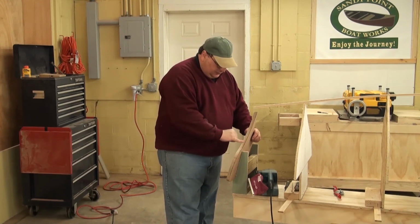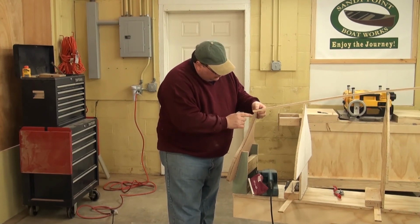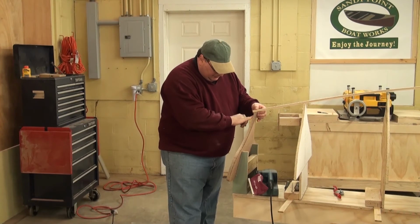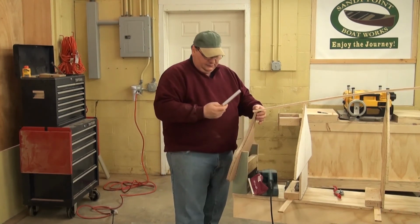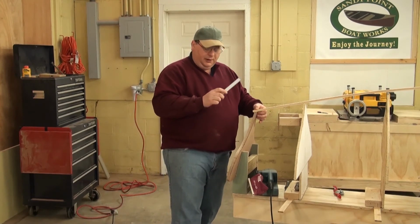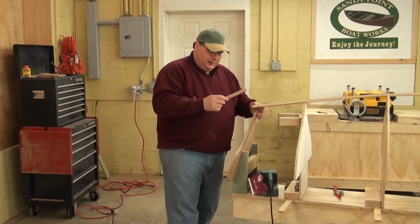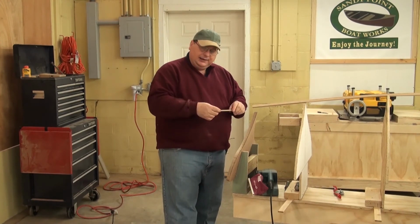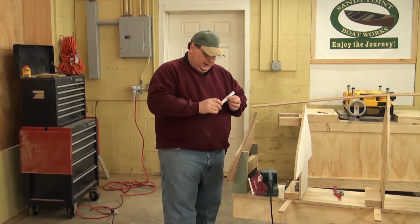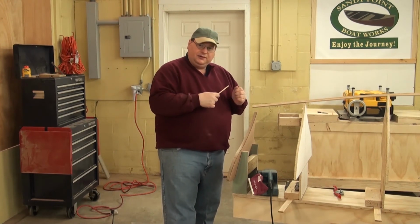All right. So I'm going to take the belt sander, and you can see that up top here I have already beveled the top of this thing. For that, I got this really simple tool that I find works really well. I take 60 grit sandpaper over a 1/4 by 3/4 inch piece of hardboard. With the spray glue that we put the patterns down with, spray a little bit on the wood, lay it down, and then cut the sandpaper. It basically makes a little rasp. And as this starts to wear down, I pull it off and do it again.